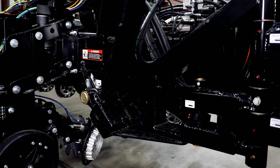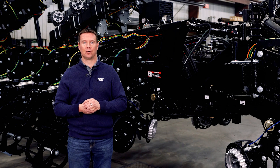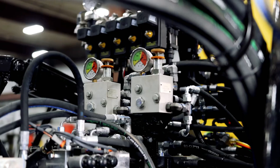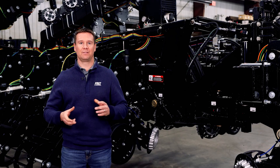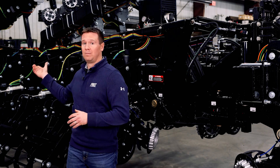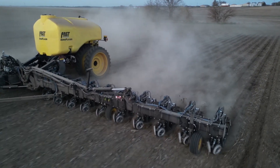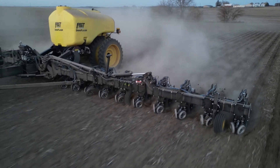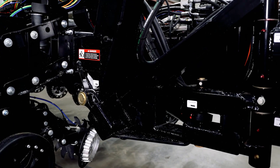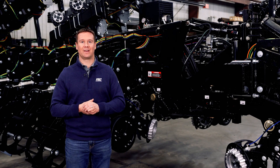Let's take a look at our innovative toolbar design. This toolbar design utilizes many of the same concepts as our proven A-Series toolbars, providing four separate upward and downward toolbar flex hinges across the toolbar, each with adjustable hydraulic downforce. These flex points are at the ends of the center section as well as hinges for the flip wings. We utilize our tube laser very effectively in order to fit tubes together like a puzzle and then weld them together to make extremely strong and tightly tied hinge points.